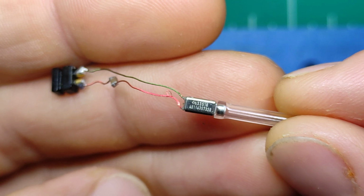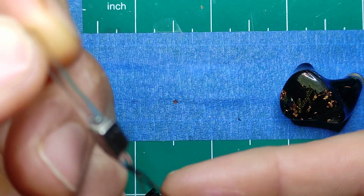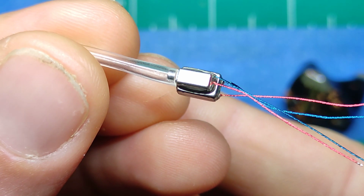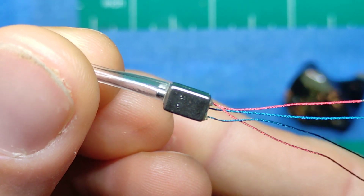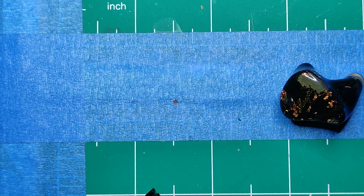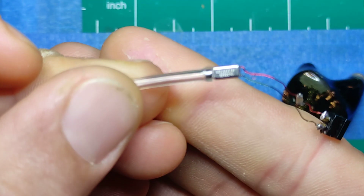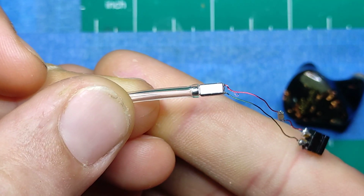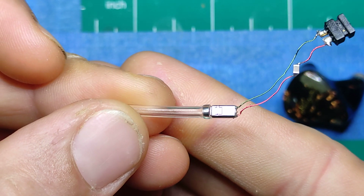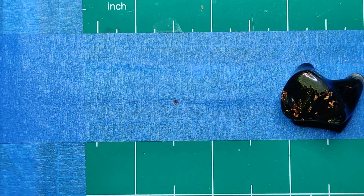If you ever find an IEM that's like a hybrid or whatever, companies can skimp out on the other BA. So for example, these are a few more BA from my OnePlus 3. These are e-audio, so you can see they're unbranded. One is a 29689, the other is a 50060. But when it comes to treble BA, you don't want to skimp out on the BA. You want to go with the very best that you can get for a reasonable price, and those are Knowles. So I don't ever use anything cheaper than Knowles for my treble, just because it's a long story, but you just can't skimp on a treble BA.